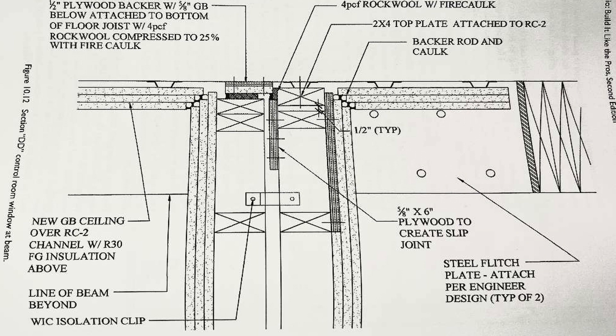But if you're using hat channels or any hanging system for your ceiling, it's still technically connected. In that case, leave that same quarter-inch to three-eighths-inch air gap (six to nine millimeters) to reduce vibrations traveling from ceiling to walls. The process is the same: leave a gap on the first layer of drywall, insert backer rod and acoustic sealant, then hang your second layer of drywall on both the ceiling and wall, leave another gap, put in backer rod and acoustic caulk, and seal it up.